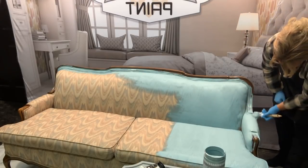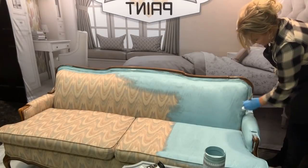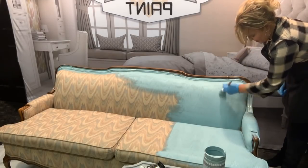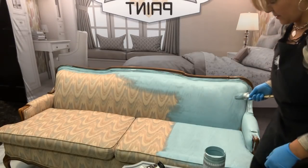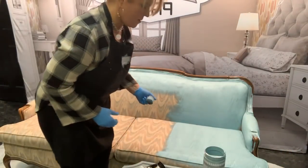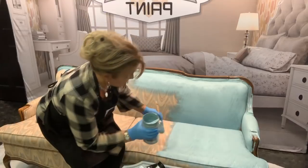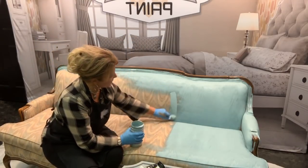I'm using our Syntek brush, which is a nice long-bristle brush that holds a lot of paint. It allows me to really work it down in there. Notice I'm going back and forth a lot — that's to push the paint down in there. Where I don't do that I can see the threads showing. The paint will dry and sink in a little, so before you start your second coat always let the first coat dry well — that will save you a ton of paint, and the less you paint the less stiffening you'll get.